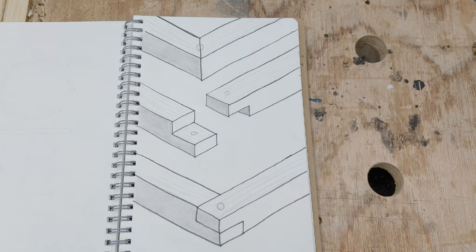If I make my squares using mitre joints, they'll look fancy, but I'd be drilling holes for the fishing line straight through the join line. I think the best solution for all involved is to use lap joints instead. That way the holes won't interfere with the joint.